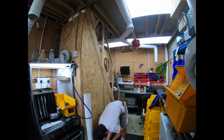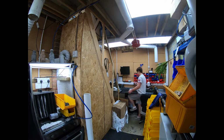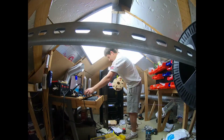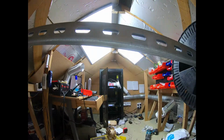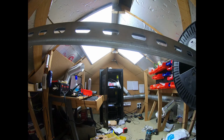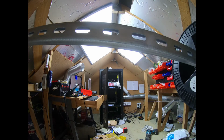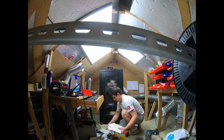And the thing I have to think about is, obviously a duct is coming in there at the minute. I think I'm going to have to lower that a little bit because it's obviously not level at the minute, it's sweeping up anyway. But it may well need to sweep up because it's likely, and I could certainly tell you, that I'm not going to get that filter box in tight enough up there to be in line with that hole. And I think the F7 filter box is bigger. So it's likely that we're going to have to have some sort of thing where the duct comes in a bit lower, feeds into the filter boxes, and then jumps up and out, which isn't exactly ideal.